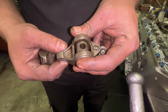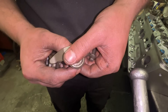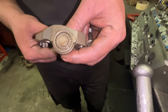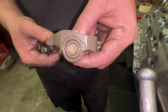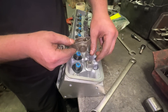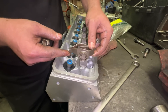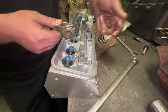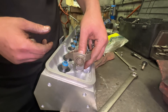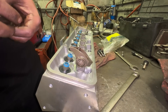These do not have a roller tip, but I don't really think that makes much of a difference in a normal performance engine. If you had a crazy high horsepower engine making like 1500 horsepower, yeah you'd want the expensive nice rockers. But for a budget build, this is the best budget roller rocker you can get for a small block Chevy. Also, rather than having an adjustable stud, it has this pedestal, which is significantly stronger — we're talking double the thickness of even a 7/16 stud. You're not going to have any valvetrain deflection with this; it's very capable just like an LS valvetrain.